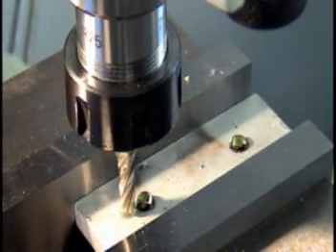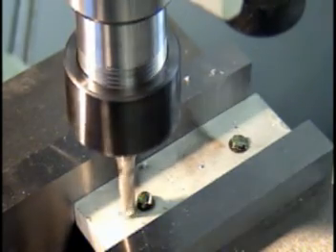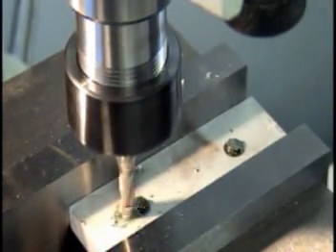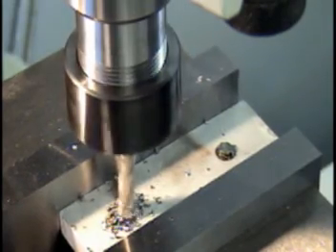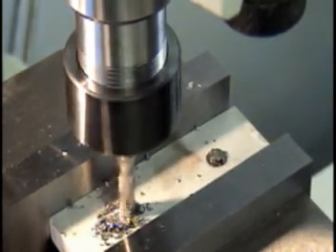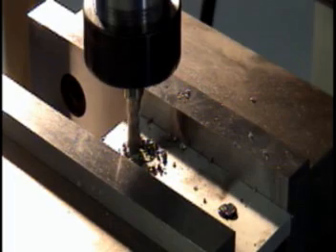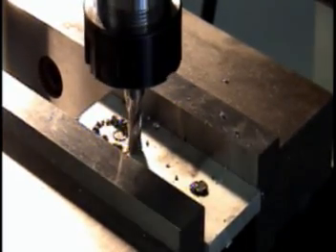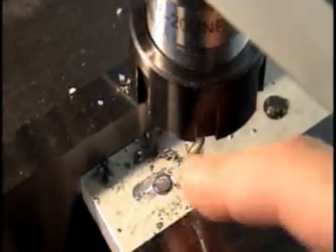First I've got to touch off on the surface — right there, we're hitting the surface of the metal now, so I can cut across. We'll move the cutter towards us and go the other way, and that will finish facing off that screw head. You can see a little skid mark where the cutter hit, but the head of the screw is now flush with the material, so it sits right on the bottom of the cabinet nicely.